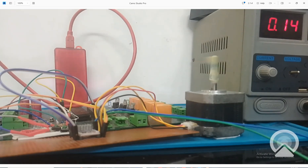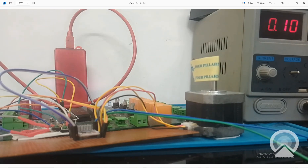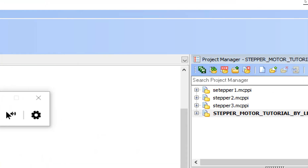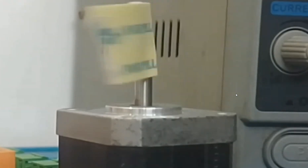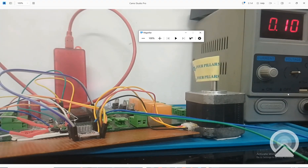You can play with this code as well. I will share the MicroC files in a Google Drive link in the description so you can download and experiment. Try different voltages, speeds, and revolutions. The main thing in stepper motor control is the step size — 200 means one complete revolution, 800 means four revolutions. You can see it going four revolutions, stopping, then going in the opposite direction for four. I hope you learned something from this video — thank you very much and have a nice day.